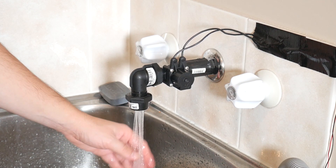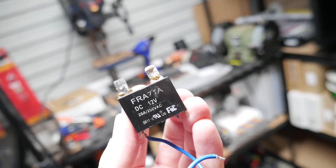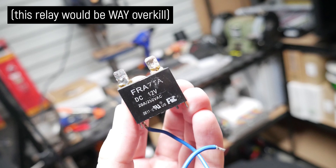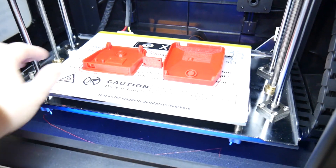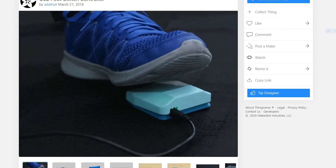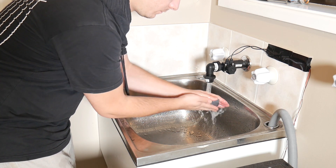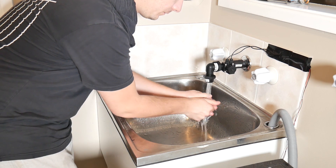There are many ways you could improve on this project — this is by far the simplest approach. Ideally, a small relay should be used to handle the current from the solenoid instead of just the switch, to greatly improve its life. Secondly, if you have access to a 3D printer, you can try to 3D print this foot switch design by Adafruit, which is easier to use, seals the electronics better, and should be longer lasting. Finally, you might want to consider expanding the system to allow for hands-free soap dispensing, something I intend to look into in future.